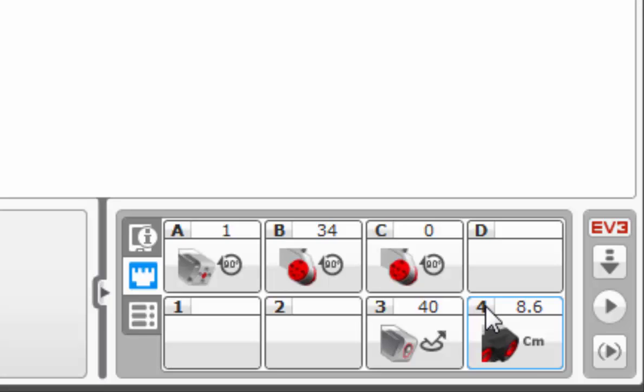Something else I'd like to point out is this number right above the ultrasonic sensor that seems to be fluctuating just ever so slightly. That is because it's actually detecting the arm which is lowered in front of the robot right now. I'm going to lift the arm out of the way, and you'll see that the number got much larger. Now I'm going to put my hand directly in front of it - you see now it registers that there's something roughly 5 centimeters away, which happens to be my hand.